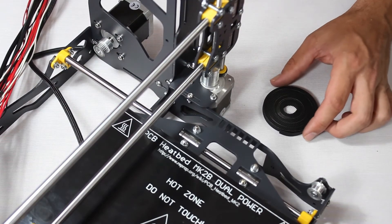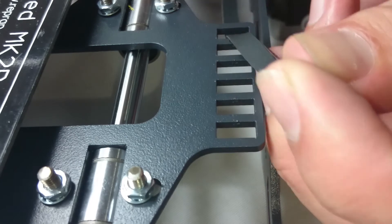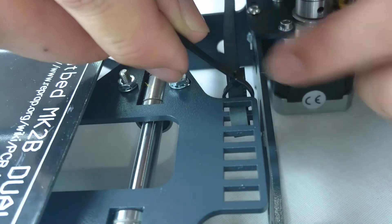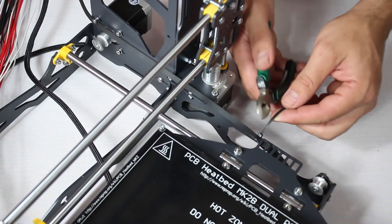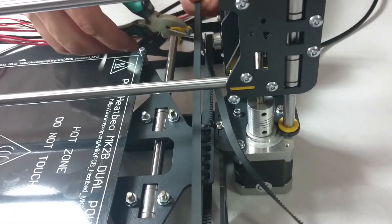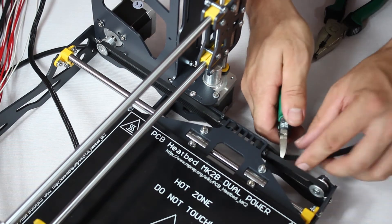Onto the drive belts. You have a single coil that you need to measure out and cut. We start with the Y axis belt. Thread the end of the belt drive into place. Note that the belt has an orientation — when it's looped around the pulleys, it must have its teeth facing inward so as to have traction on the tooth pulley. The belt tips are held in place with cable ties; consult the manual to ensure you use the correct ones. Once fastened, cut off the tip of the cable tie with cutter pliers. Loop the belt around either pulley, stretch it, then cut it, using the build plate edge as the reference for the cut. Fasten the end onto the bracket, apply a cable tie, and cut the excess of both the tie and the belt.